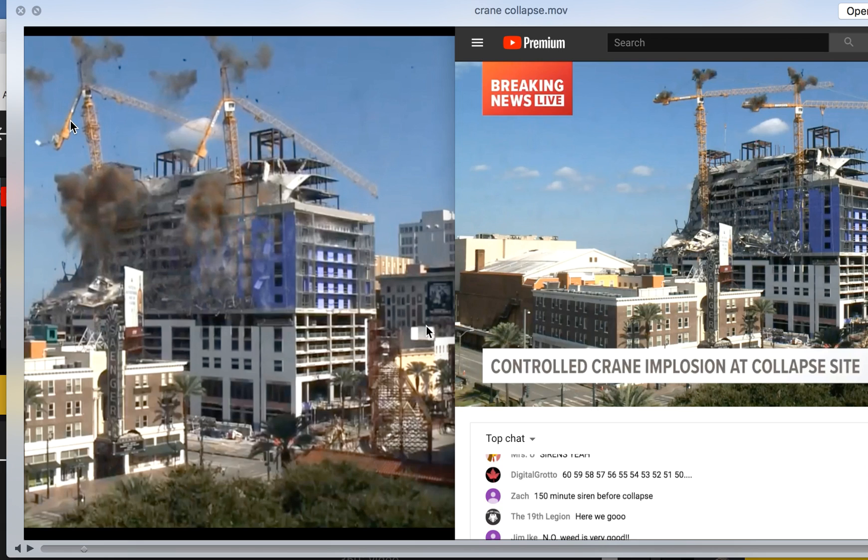Without a secondary blow, it's naive to think this would just fall down right there. All you did was blow a leg section out of it and it's now entangled again. What you're looking at now is a hinge — it's a hinge at this point. You just blew that point out, it's out of equilibrium, and this is going to be your controlling force. It will pull it over. So now there are no more explosions — just look at this as a static piece of material. We've got a counterweight on this outside elbow, also on a hinge, that might want to swing. The turntable I think is locked, so I'm not sure we have to worry about that.